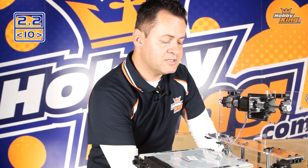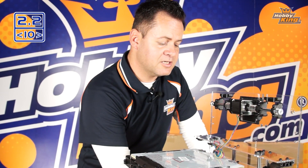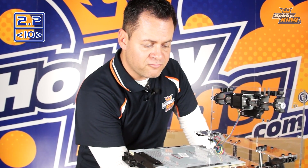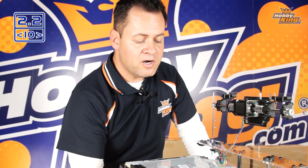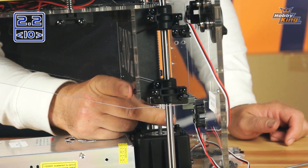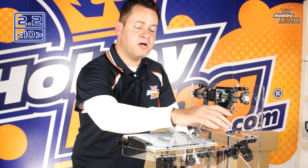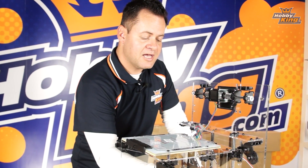It might not even bind, but just do this process — even if it feels smooth, you'll be surprised at how much smoother it actually gets. I've got a good frame of reference of how much torque it's taking to rotate this. Be aware that this lower collar is not tight to the motor itself, so the motor at the bottom should not be rotating. As we turn this, all we're rotating is the Z-axis lead screw, and the bed moves up and down as we rotate that. We're just feeling the drag on these bearings going onto the linear rods and the tension between it and the Z-axis.